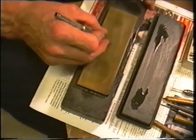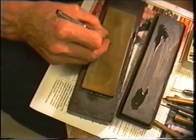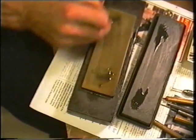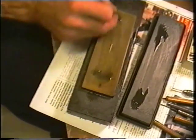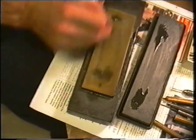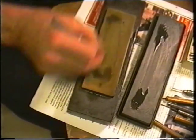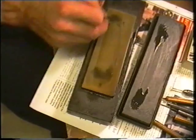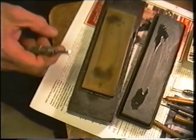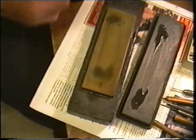All you need to do to pick up the grinding face you want is just carefully position the graver on the stone, watch the oil expelled, and then a few quick rubs and you're in business. You can go around in circles if you like, or you can go up and down. You'll find that if you practice along those lines, you'll have no difficulty producing a nice flat face on the graver just where you want it, and in the long run it'll save you a lot of time.